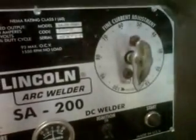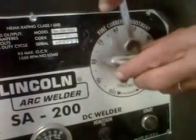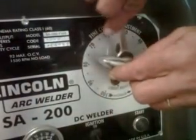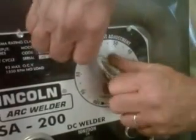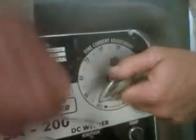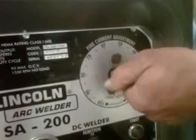Take a 7/16-inch wrench — there's a lock nut — and lock that into place. Then rotate it around and find the stop. It stops at 100, and going the other way, it stops at 10.